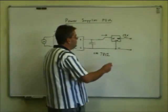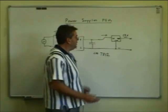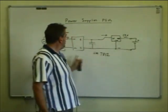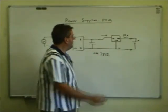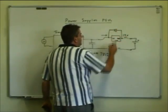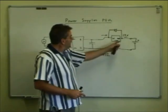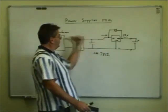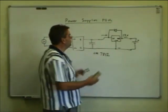One thing that will kill them faster than anything else is if you put a higher voltage on the output than the input. The classic case is if you're using it to charge a car battery, then leave the battery connected and switch the supply off — now you've got zero volts on the input and 12 volts on the output. They don't like it, and I've been guilty of that. To protect against this, you can put a diode across the output: the diode will be forward biased and most of the voltage will be limited to 0.7 of a volt across it, which it can cope with.